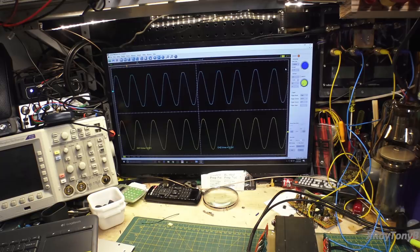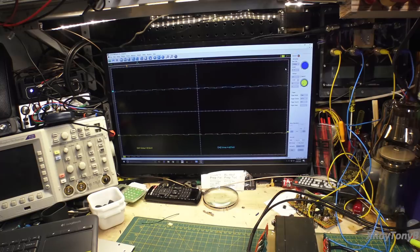We have just around 10 volts RMS — 10.0 here, 9.94 here — and those zigzaggy artifacts are just the poor resolution of the scope, not distortion. We have almost exactly 10 volts before we really get into clipping. If you do the math on that into an 8-ohm load, you're right around 12.5 watts. This thing is rated at 13 watts and I believe it — it's more like a 12-watt amplifier. As the tubes burn in a little more I think you may get a little more out of it, but it's safe to say this is very cleanly 12 watts per channel.